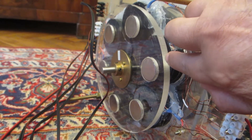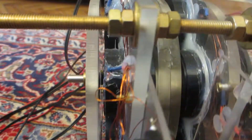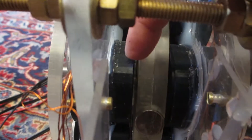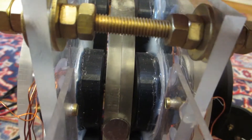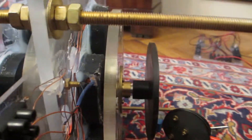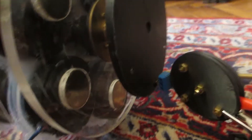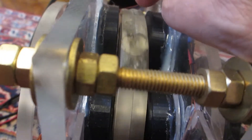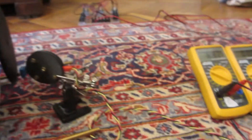Here is the machine. We have six magnets, 30 millimeters and one centimeter thick. There are two rotors in the middle, which means the magnets are twice as thick — two centimeters thick. The third rotor is like the first. Here's the timing disc. There are three magnets in south-north orientation. There are also some magnets on the middle rotor outside, but they're not used here.